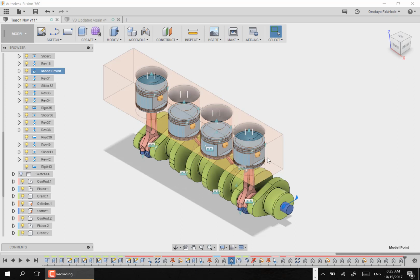But for the cylinder, cylinder 4 is at 360 degrees. And the last cylinder to fire is cylinder 2, which is oriented at 540 degrees. 540 degrees, because of our circular, again, period of 360, 540 coincides with 180. So this cylinder orientation is actually 1, 3, 4, 2.